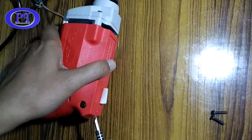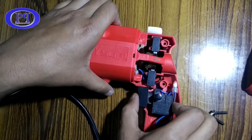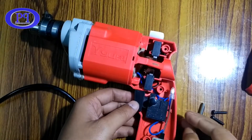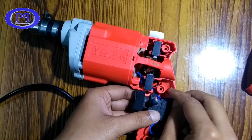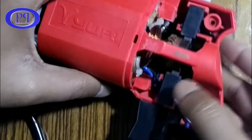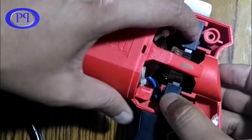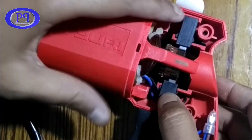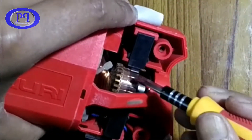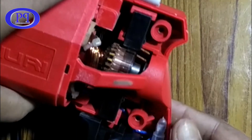I'm opening the back cover. Here I've removed the back cover. This is the push switch — or you could call it a pull switch — because whenever you hold this drill machine you need to pull it back using your forefinger. This is the carbon brush which has fine contact with the commutator connected to the rotor. You can see the upper and lower carbon brushes making contact with the commutator, with individual contact points where each split has an individual connection to the coil.